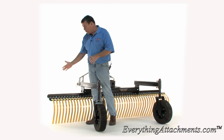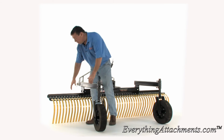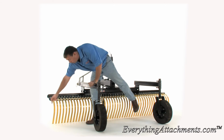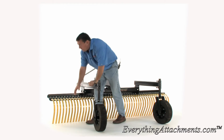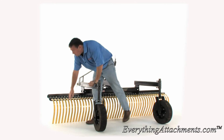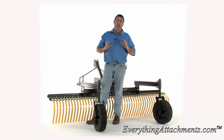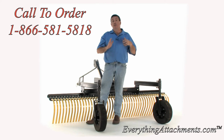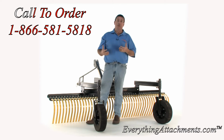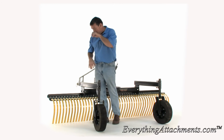So what they do to make it stronger and keep their tines from moving around is they put a girdle, is what I call it, which is 2 strips of metal that run all the way across every tine and have a bolt between them. But what that does is it makes the tine get solid, more like a scrape blade with grooves in it. And that's not what you want. You want those tines to work like fingers so it keeps the dirt getting removed off of your debris and not collected. You want them to work as much like a spring as you can.